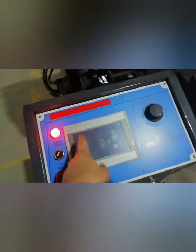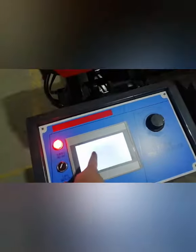Open the cabinet, so you can see here. Connect the 3-phase electric wires here and make sure it's in good connection. After you connect well, you open the switch to give it power. You can see after it gets power, the light is on, and the PLC system will also light. It's loading. Next you release the emergency stop.